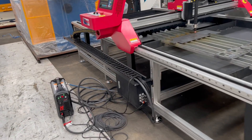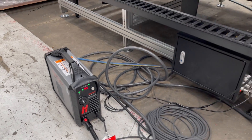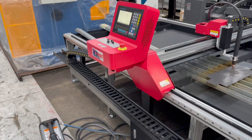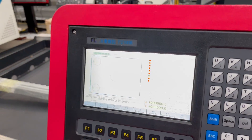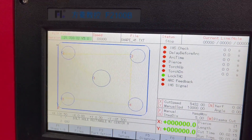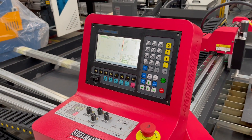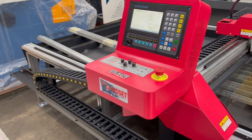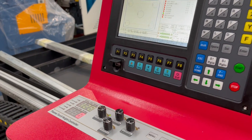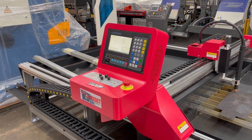This particular customer is a toolbox manufacturer, so he's coupled it up with a Hypertherm 45, and it also runs FastCam software. Kalen's set up a small program off the library. It has an industrial shape library on the control console itself, and with FastCam via USB, you can upload fully nested programs from the PC onto the control panel.